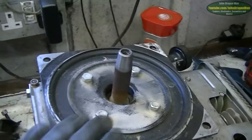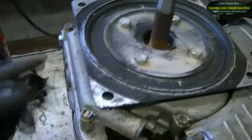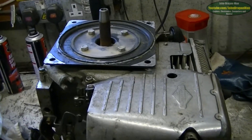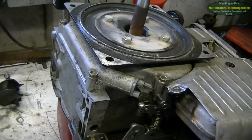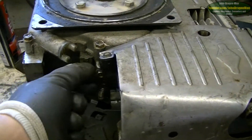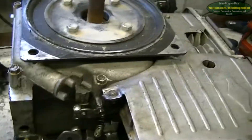Now there are four bolts to hold that plate on, and then these outer bolts here. I can guarantee I'm going to knacker the oil seal — I'll worry about that when the time comes. This has all been worth it if I can actually fix that governor, which is that thing there. Because at the moment it doesn't do anything. At least it's on this side of the engine, so I haven't got to dig through the whole engine to get to it.